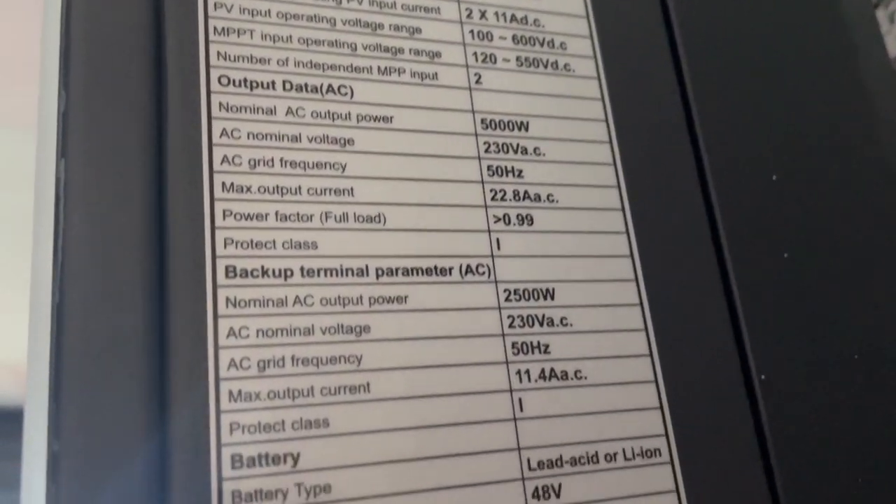So why did I choose the 9.5? Originally I was quoted for just the 5.2kWh battery because I'm a relatively low user of electricity, but I decided to go for the 9.5kWh instead to future-proof the home and allow for flexibility to maximize the return by utilizing tariffs such as Octopus Agile and more recently Octopus Flux. The thinking was that the 9.5kWh gives a little bit extra storage I could use to discharge to the grid at peak times, and also allows for additional capacity if I decided to purchase a heat pump, electric vehicle, or even get my hot tub back out when the sun's shining.